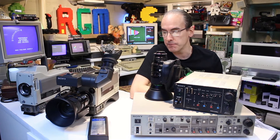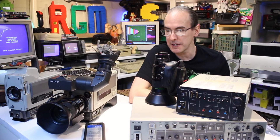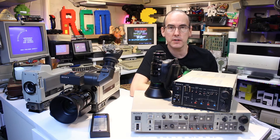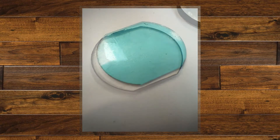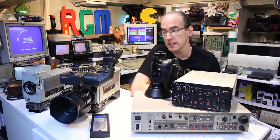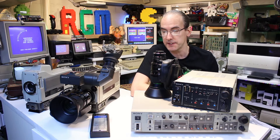So I had a closer look at the infrared filter. Looking at it, I thought it looked like the lamination had come away, or the glue bonding all the layers together. I thought, what if I could pry those apart without breaking it, clean off the old glue, and just pop them back in and see if it would work. So I did start taking it apart. Unfortunately I did end up scratching one of the elements slightly because I used a Stanley blade to try and separate them and it ended up slicing through quickly. But I managed to clean up the segments - here's a picture of them now, all cleaned up. As you can see, they're looking a lot better.